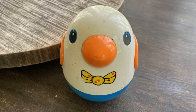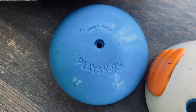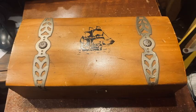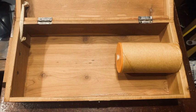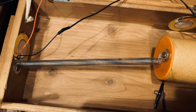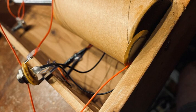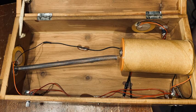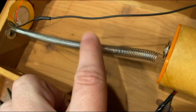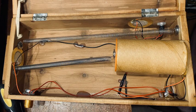To make a chime box, you need to find a wibble wobble chime toy. These come in many forms in both stuffed animals and plastic baby toys. For example, I found a large chime in this plastic Play-Skool toy. I found a clasp-hinged wood box at a Goodwill to house my chimes. I added two outputs with piezos: the first is a stereo eighth-inch out with two piezos to create an acoustic stereo effect; the second is a mono quarter-inch jack with two piezos and a potentiometer to mix the signal from a piezo directly fixed to the chimes and from a piezo at the opposite side that makes contact with the spring to create a reverb effect. I decided to add an additional spring to amplify this effect.